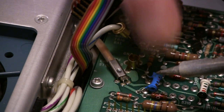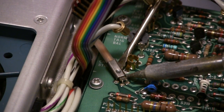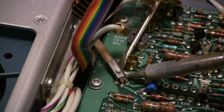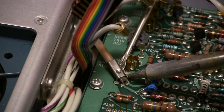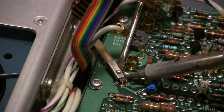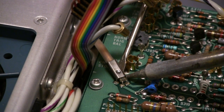The last connection to remove is the delay line. Three of the pins are in the socket pins on the board, but one pin on this side is soldered. So, trusty soldering iron - move this capacitor out of the way. The easiest thing I found is you heat the joint and wedge a small screwdriver under it until it comes out. It's supposed to be a heat relief, but it goes into the ground plane so it takes quite a bit of heat.